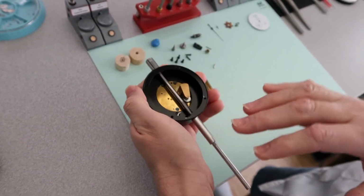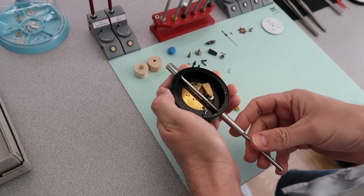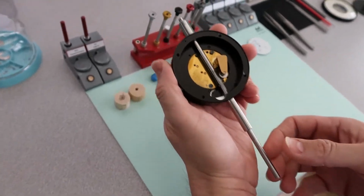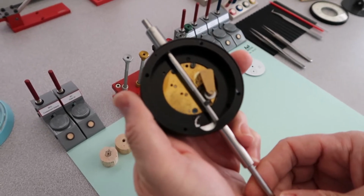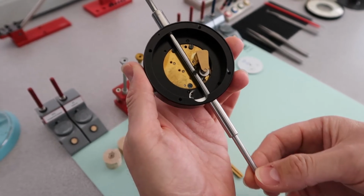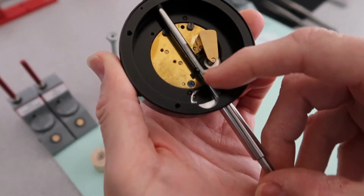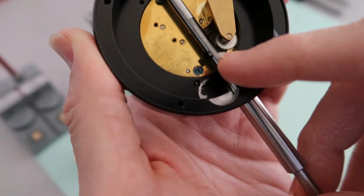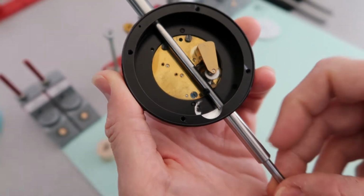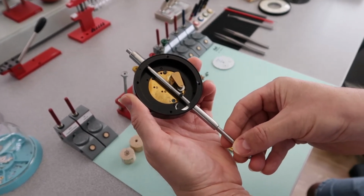So we completely took it apart, cleaned all the parts, and when reassembling it, I ran into a problem. How this dial indicator works for taking measurements is that this is the main post that moves up and down. If you look very closely, there's gear teeth on this post, and these gear teeth drive the gear, the wheel right there. It's really important that the post moves up and down but does not turn